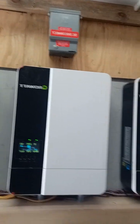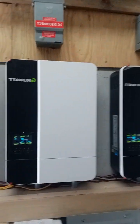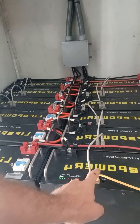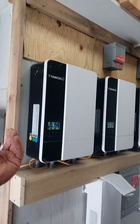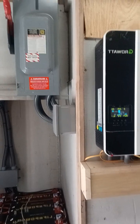I like to put things in the center or all the way to the left when I'm doing these series. Again, this may be 1, 2, 3, and 4 as it states. But try to put the incoming power to the closest inverter in the center as much as possible — it just helps with balancing and discharging. What that means is if this wire were all the way to the other side, it would have to pulse and communicate to make sure all four were syncing and transferring power, which is no big deal. I just like to keep things in the KISS theory.